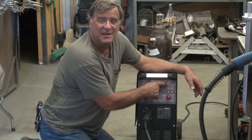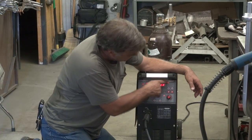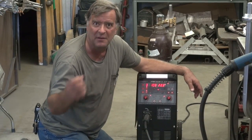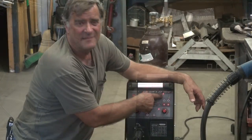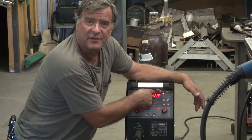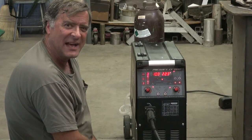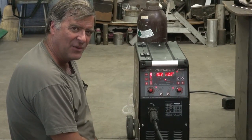Over here in this corner, this is your setup location for the different kinds of metal you're normally welding with. They've got FE on the top — that's steel. They didn't spell it out like stainless or aluminum; they put the chemical name up there instead. And then on this side you've got presets for the different wire diameters from .03 up to .06. This one's a little complicated — you've really got to stop, look at it, and maybe check a book to figure out what you're actually doing.